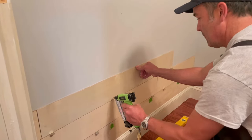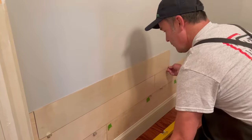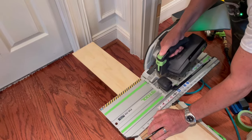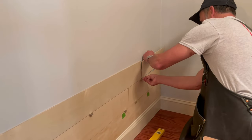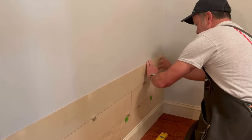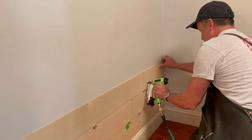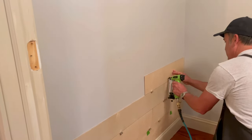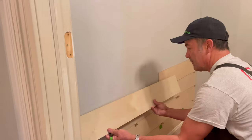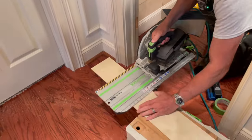You could use something else, but I find nickels to be just the right amount of spacing. There is even a shiplap called nickel gap shiplap for that reason. I'm working alternating back and forth along the wall, and when I get to the last piece I mark it with a pencil, take it to the saw, cut it, and leave about a nickel space between the two pieces for consistent spacing. I love the pin nailer because it doesn't have heads on the nails and paint will fill the holes.